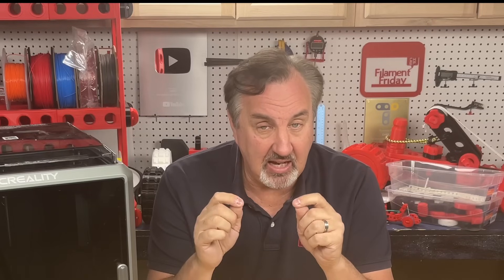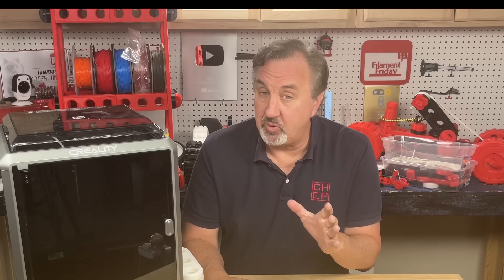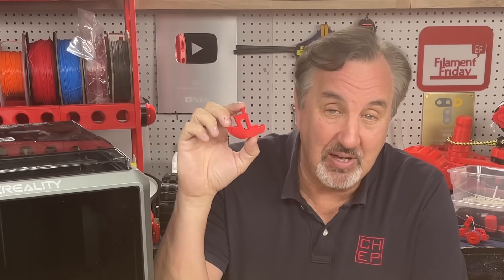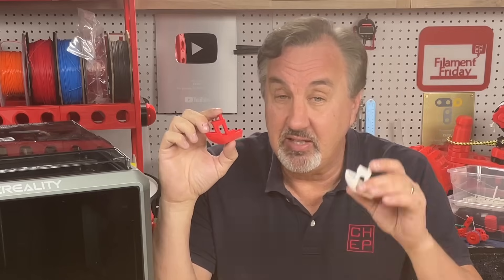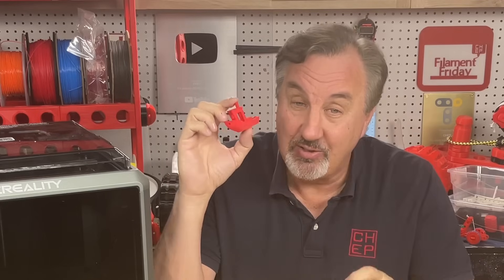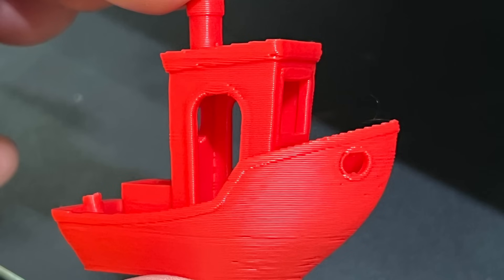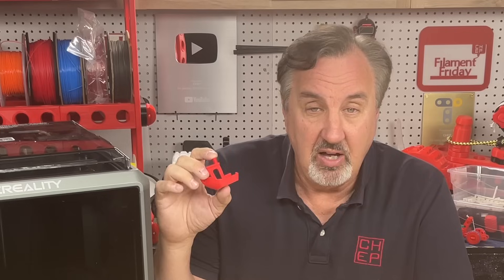So I pulled Simplify 3D off the shelf. They sent me a copy of their new 5.0 and I updated it to the latest. I found that the speed settings for their K1 and K1 Max profiles are much slower than what's in Orca Slicer and Creality Print. I adjusted the speed settings in Simplify 3D to match those slicers and the result was a 13-minute Benchy. It's not as good quality as the 17-minute Benchy that comes with the machine, but it's faster and not bad at all. The sides are pretty smooth, with a little under-extrusion on the top and floor that I could probably adjust out — but I'm starting from a low point of 13 minutes.